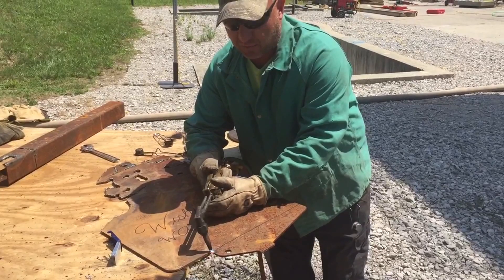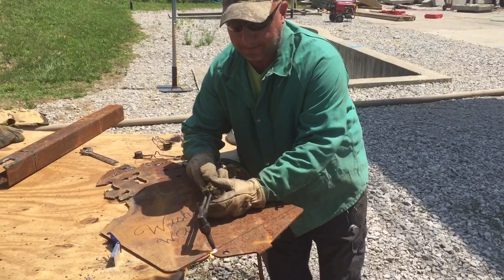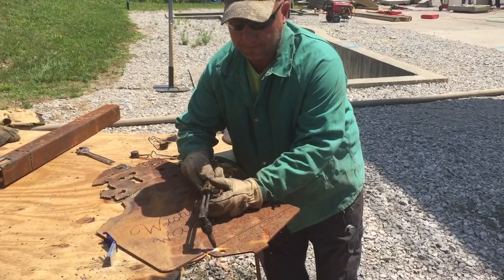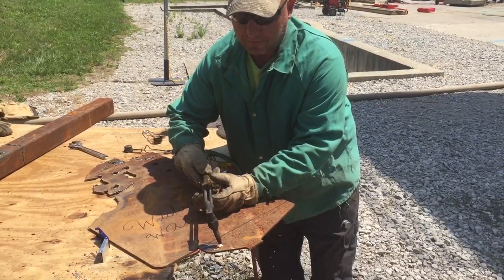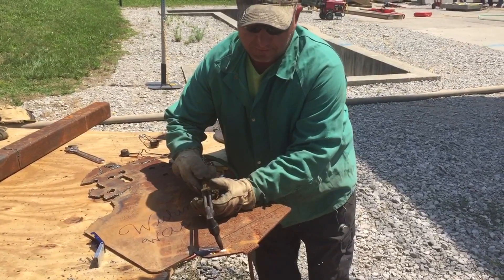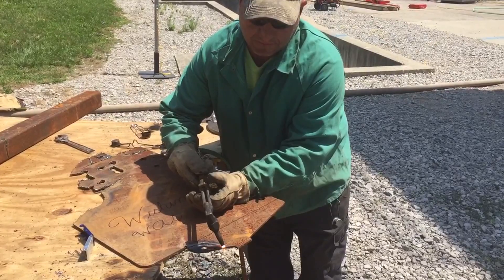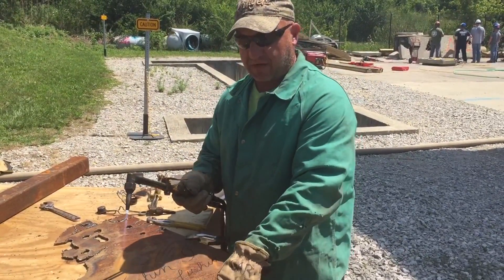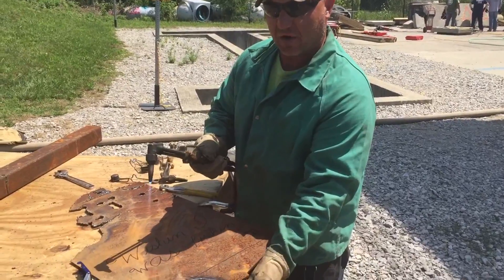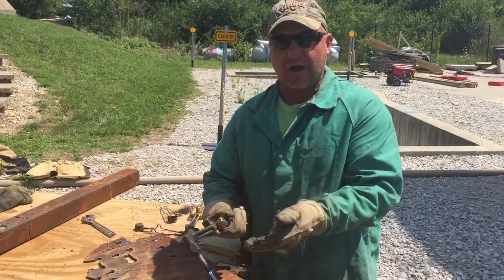When you start your cut, come to the edge of your piece at a 15-degree angle and bisect the edge of the piece. Once it becomes molten fully, press the cutting oxygen valve and make your cut. It should drop off nice and neat — you should have minimal slag on top and minimal slag on the bottom, which tells you that you used the right cutting angle, the right cutting speed, and the right cutting flame.